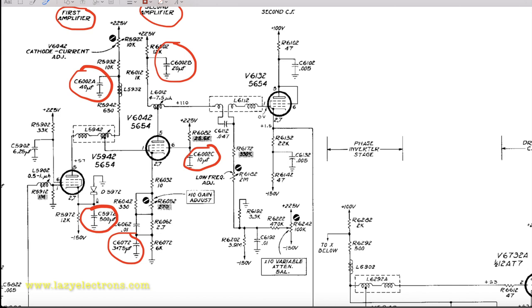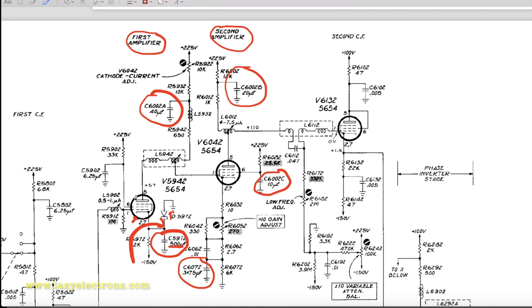There's also a diode here, which is interesting. They put this diode to protect the capacitor, because even though it is 500 microfarad, the voltage is only 6 volt. In case somebody pulls this tube out and inserts the plug-in back, the whole 150 volt is going to come and attack this capacitor. To prevent it from being ruined, they put this diode here. Then we have a bunch of small 6.25, 300 volt electrolytics, again used as decoupling capacitors for the power supply. So that is the quick overview on the use of these large electrolytics in this plug-in.